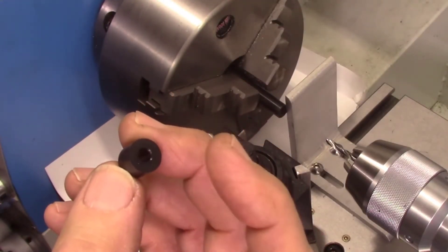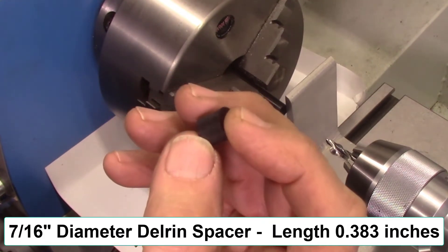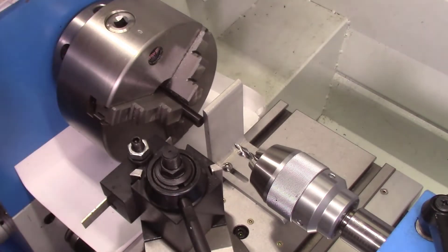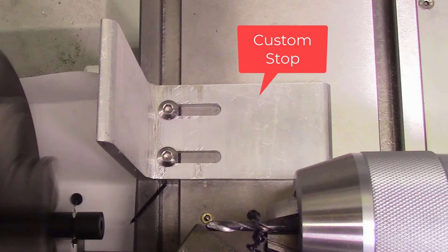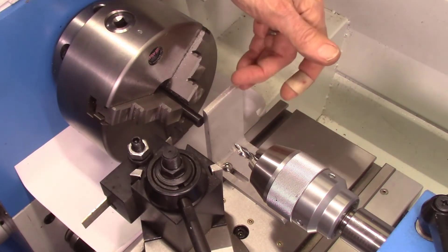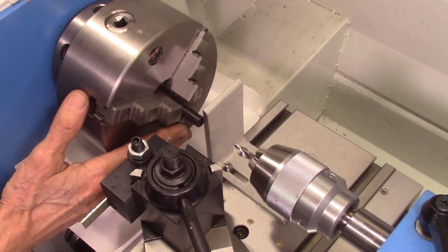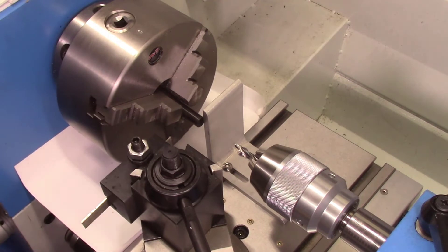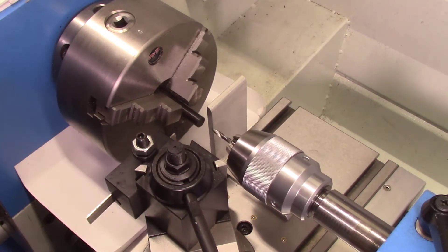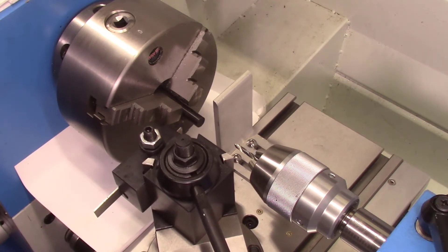These Delrin spacers are actually quite simple — nothing more than a piece of 7/16-inch diameter Delrin rod cut to a length of .383 inches. That length is the critical dimension. Then it has a hole through the center, which is designed for a number 8 screw. For the setup, I had to make a stop to set the length of the piece, creating a key that locks into the plate. An L-bracket mounts on there and is adjustable so I can set the length. The Delrin rod goes through my lathe chuck, I bring it up against the stop, lock the chuck in place, move the stop back out of the way, then drill a hole through the center. After that I back out the drill and use a cutoff tool to cut the spacer to the right length.